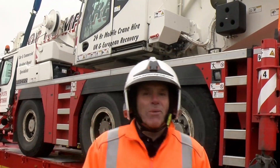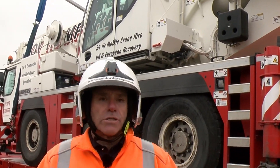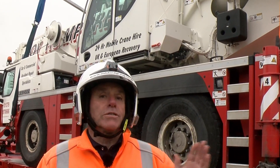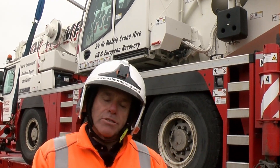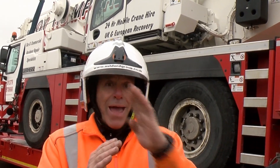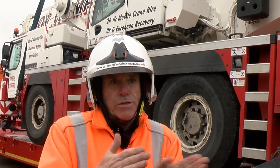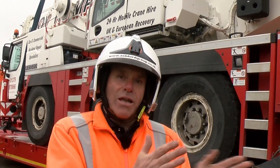A great job done by these guys — very smooth, massive operation here. Although there was no slewing of the booms, there were many operations: up and down with the booms, in and out just to move the back end across. They're working on quite tight tolerances because they have to be as close as they can to the legs, and of course the trailer has to drive alongside them with no leeway. So the front truck had to stay where it was in terms of elevation and distance, but the back one was able to move a little bit, so they've just moved the trailer in a bit more at the back to lower it down.